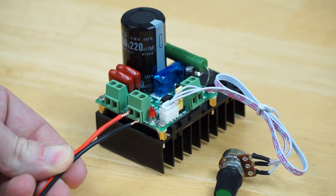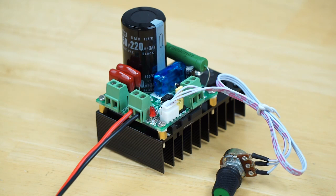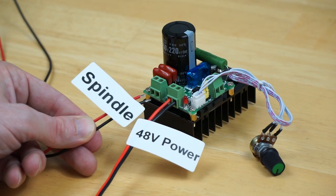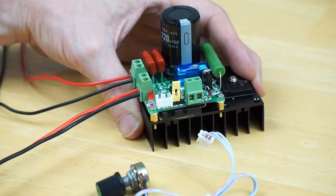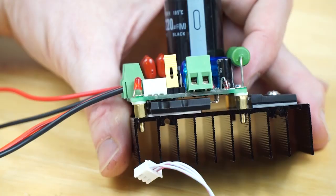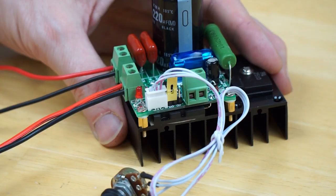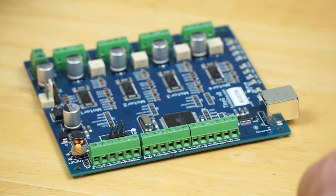The two-conductor wire carrying the 48 volts from the power supply needs to be connected to the speed controller. Use the terminal block labeled AC and DC in. The circuitry on the speed controller does not care about the polarity for the input. Now you can also connect the spindle motor wires to the terminals on the output of the speed controller — polarity does matter on the output side, so hook red to positive and black to negative. Because we are using the PWM terminals on the speed controller, move the jumper to the right position, closest to the PWM terminals. Also remove the potentiometer, as we will be controlling the spindle speed via software.